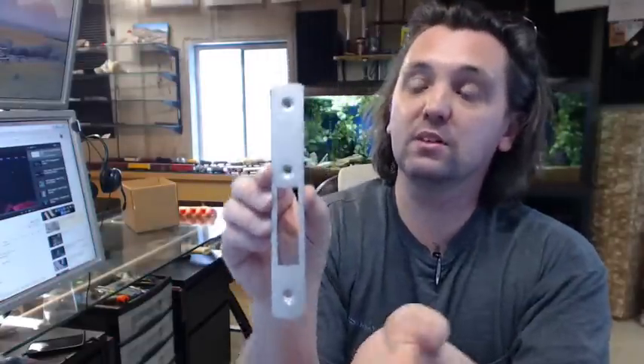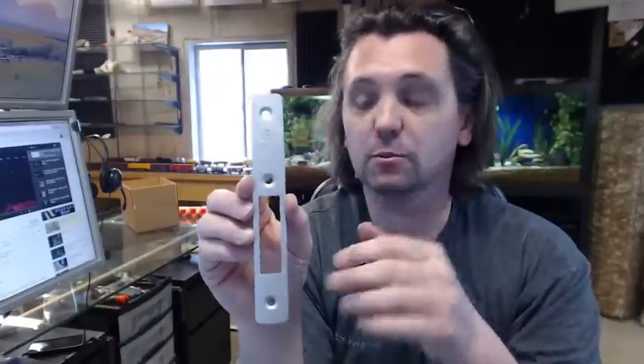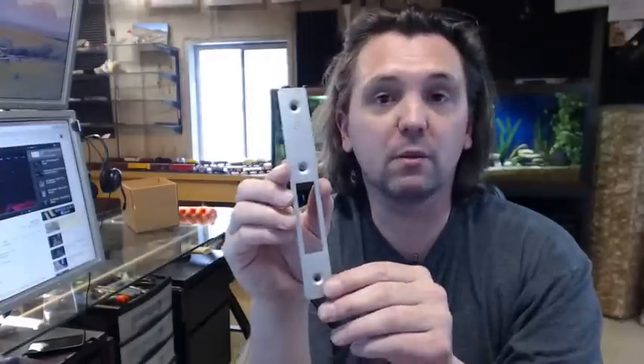People that buy these might be building engineers, building owners, or locksmiths. Plates like this are replaced because of vandalism, an attempt to break in, unintentional damage, or simply being lost. Covering up the edge of the lock is important for the proper continued working of the lock — it covers the screws that give access to the cylinder and/or thumb turn. It's a very inexpensive item and again available in several different finishes.